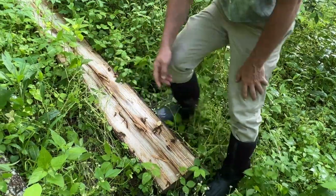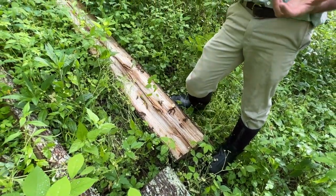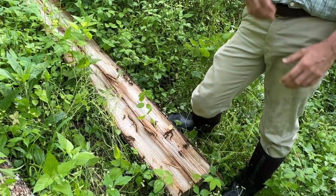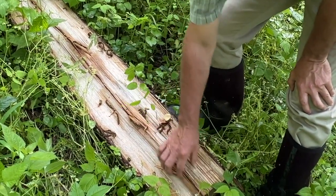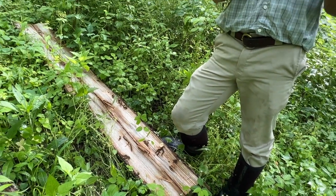The sapwood, that's the newest growth on the outside, and it tends to be the softest wood. In a case like a fence post, it's going to rot away fast. Because it's more living. Right. And the center, this is the heartwood through here, you can't use it because, for one thing, it's the earliest growth in the tree. It's got all the knots and twists on it that make it where you wouldn't be able to work it. It's going to be weak.